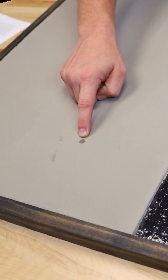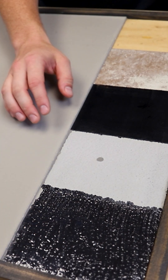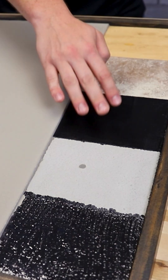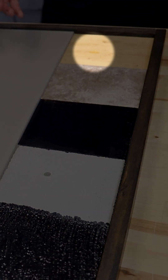You can tell on my concrete surface, I have a spot. On this epoxy, no water absorbed. Concrete — moisture absorbed in. Here we have an existing adhesive residue — no moisture. Tile — no moisture. The wood substrate — there's absorbency there.